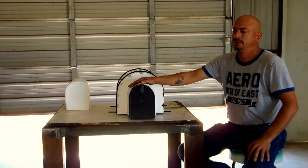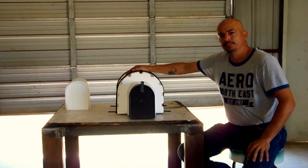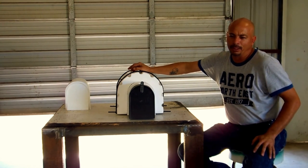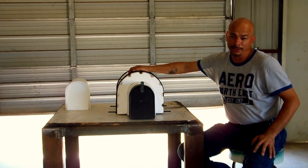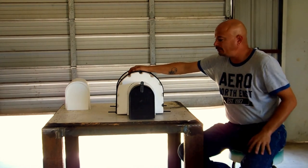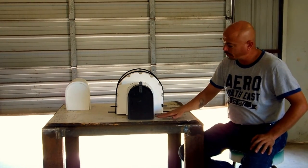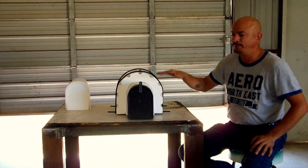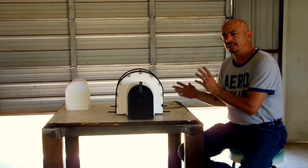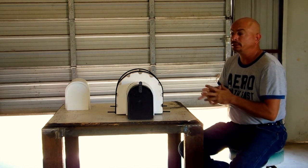It allows the consumer to save money, because it's a very expensive cost to have a new mailbox installed into an existing brick enclosure. I personally would charge anywhere from $250 to $350, and to build a new mailbox in labor alone I'm about $350 to $400. Some people do it cheaper, some people are more expensive. The problem with taking the top off and redoing the mailbox from the bottom of your steel box up is that your mortar color typically won't match, or if you chip a brick, it's hard to get the same brick to repair it and have it look the same.